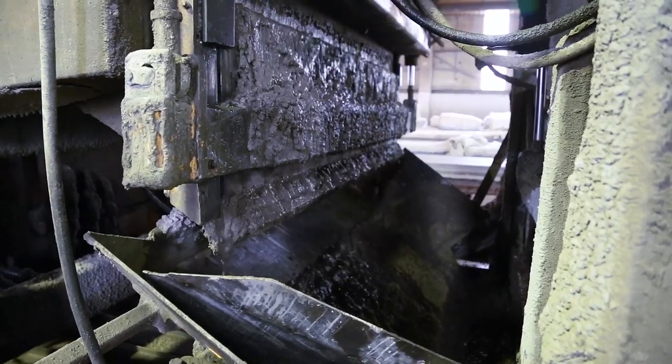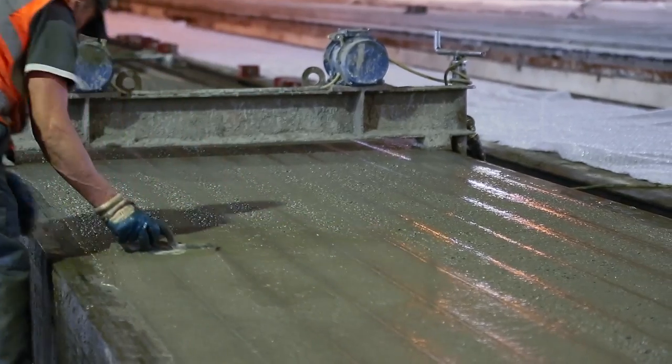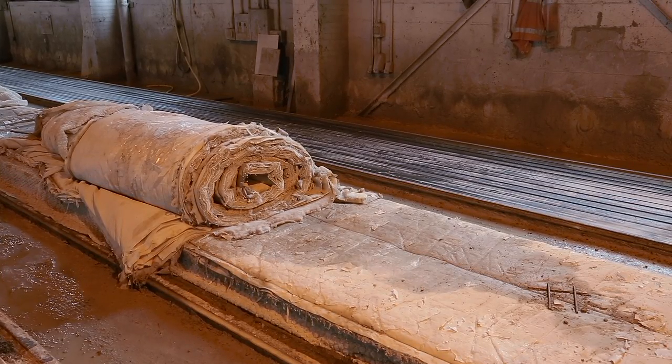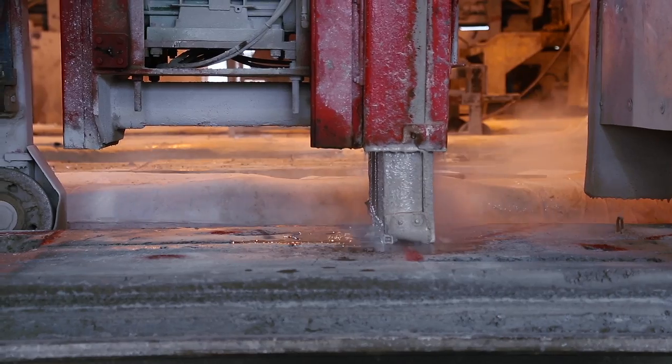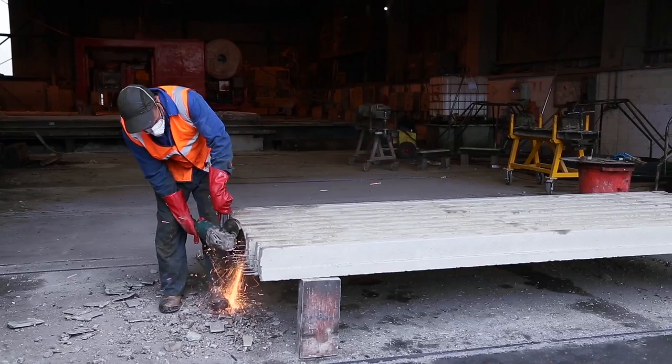At this point there is no concrete around it — it is all done in the air. The concrete is then poured around it, cured overnight for at least 24 hours, enabling the concrete to bond around the pre-stressing wire to hold the stress within the concrete itself. The concrete is then cut to size and sent to site.